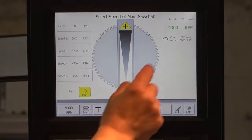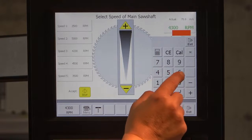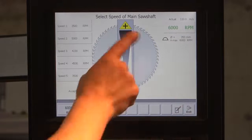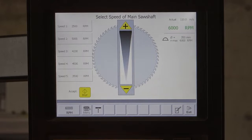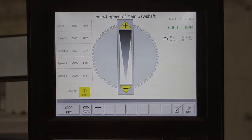If you want to enter a speed immediately, you can press directly on the field, type in 6000, press enter, and the speed changes immediately. You can also see we have a 350mm saw blade on the machine with a maximum of 6000 rounds per minute. From the tool management, which communicates with the Vario Drive, you get the cutting speed of 110 meters per second. Sometimes you know from your material what cutting speed is needed, and you can change the rounds per minute to get a higher or lower cutting speed.